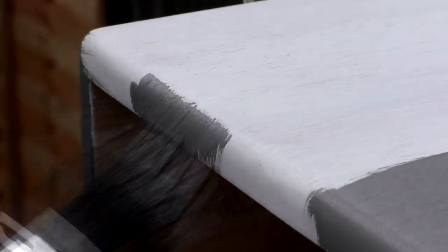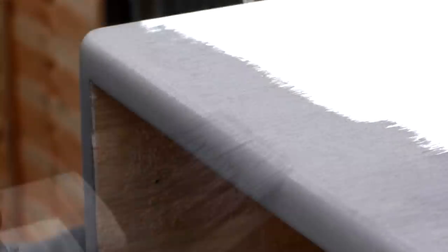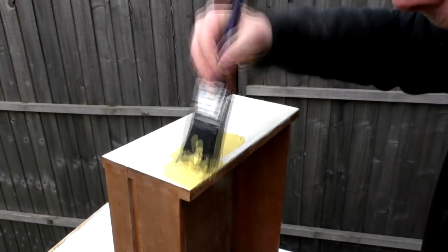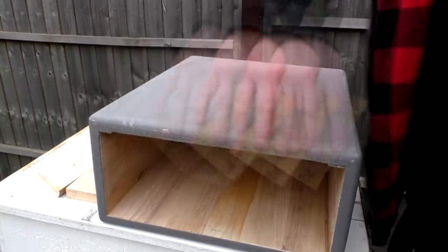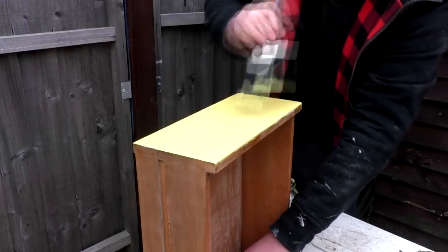The screws will leave some tiny marks on the paint but that didn't really matter on the bottom, and the legs that get added later will cover most of those imperfections anyway. I chose this mustard colour for the drawer front — this is just a tester paint tube I bought for about £1.50 and there was more than enough in this tube for the drawer front. When the first coat of paint had dried I sanded with 400 grit paper and applied a second coat. I stored my paint in a glass jar in between coats and used some cling film to keep the dust out and to save me having to clean the brush in between coats.